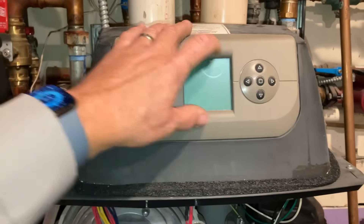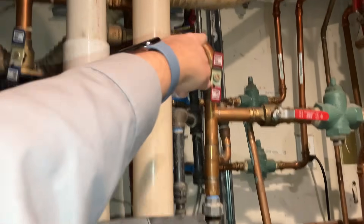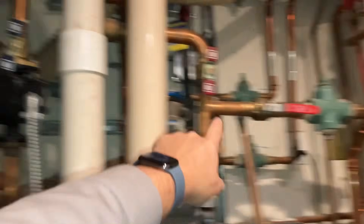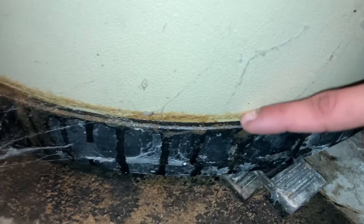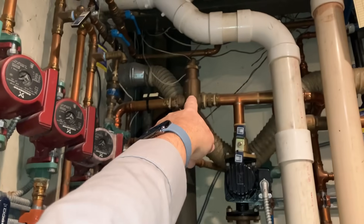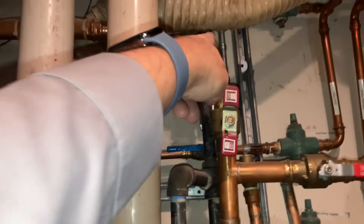And of course the condensate pump. This is the display module, display bezel, expansion tank, and then we have our supply piping. Up here on top that is the Weil-McLain primary loop piping — everything else is secondary. That's going to your indirect water heater, which has seen better days. It is actively leaking water. And we have some zoning there, and of course behind us air separator and gas going up to the gas valve.